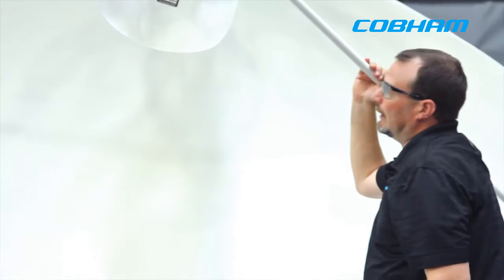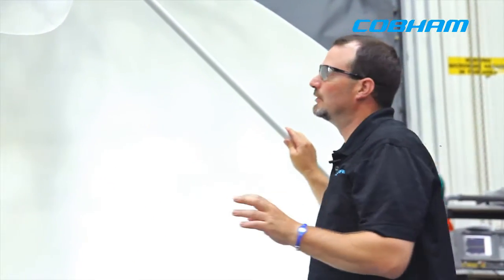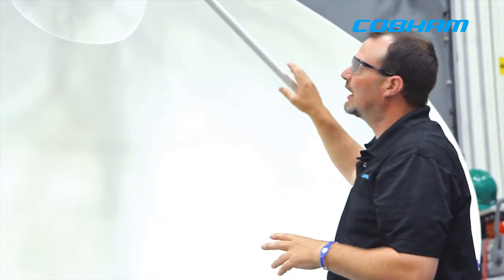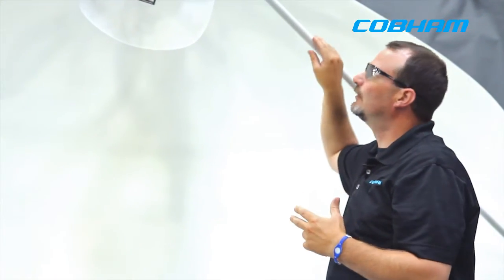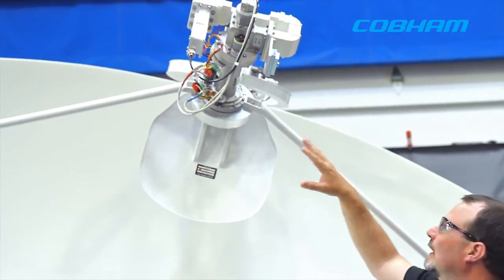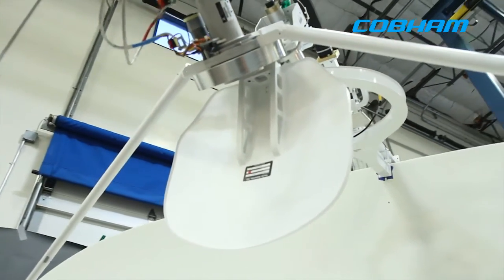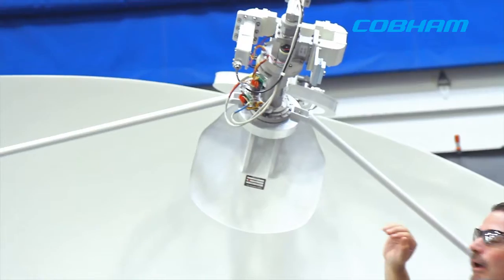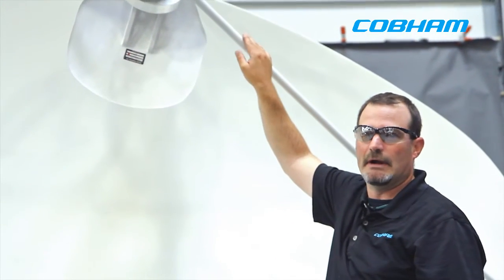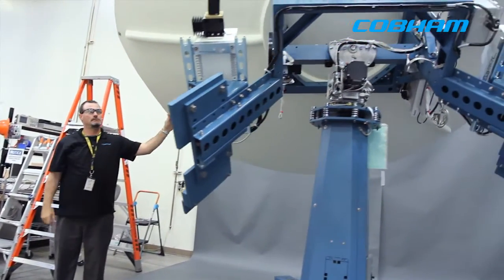You're utilizing the entire 2.4 meter cross section of this antenna for KU band mode. Before, what we would have to do to switch from C band to KU band mode was send a technician out on the vessel. They would have to remove the C band feed and the waveguide that populates it, and replace this with the KU band feed as well as the waveguide. You'd have to be a skilled technician and it usually takes between four and eight hours to do that.